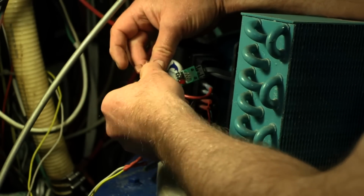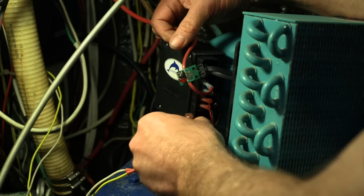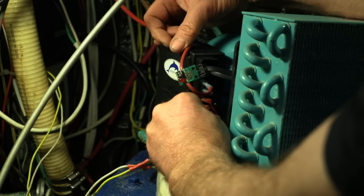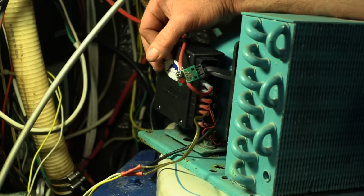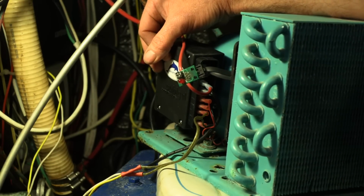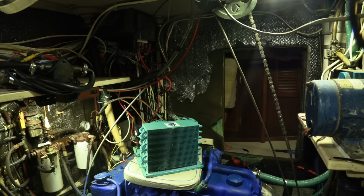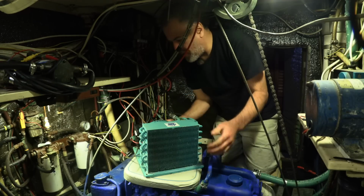The compressor just turned off. Now the fridge is pretty cold. Let's see if the thermostat thinks it's cold enough. 1, 2. Yup. The fridge is cold enough right now, so the thermostat's not telling the compressor to turn on. Beautiful. Now I just have to get the compressor back up on the shelf, and we are done. All right. The careful part.